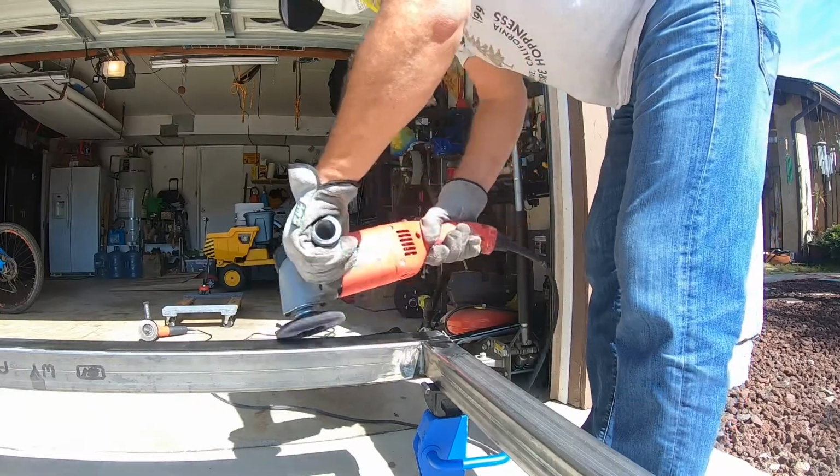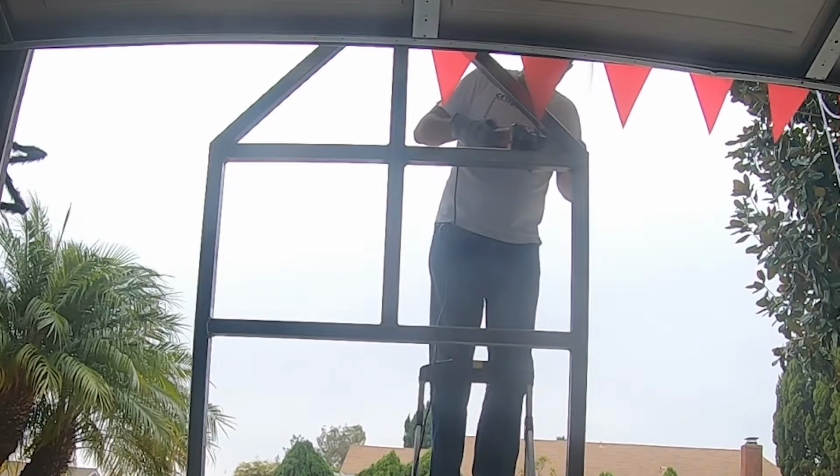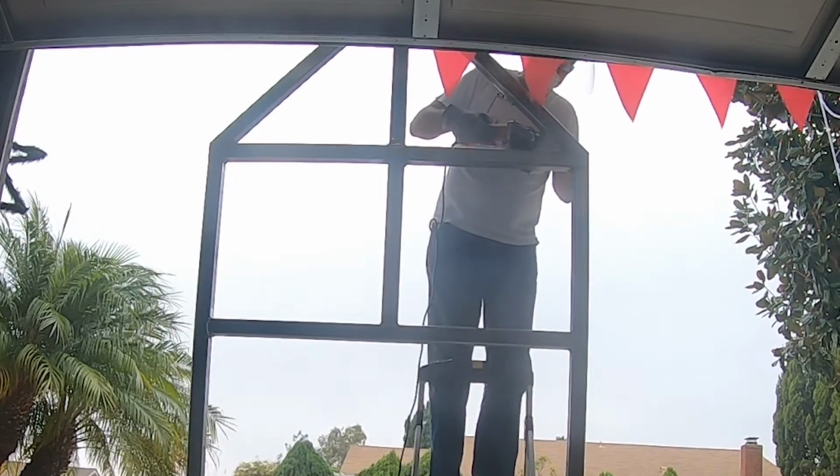Before you weld tubing together, you've got to get it prepped, which means removing the mill scale, which is a hard shell that forms on the outside of the tubing when it's heated up and extruded. I recommend taking all of the mill scale off before you weld things together. It's tempting just to remove the mill scale right around the edges of the tubing where you're actually going to connect the pieces together. But it's really a pain to go back and remove the mill scale later, just getting all the corners and stuff once you've welded up.